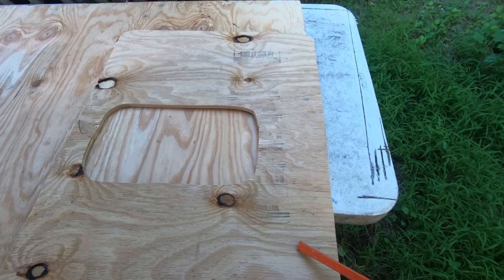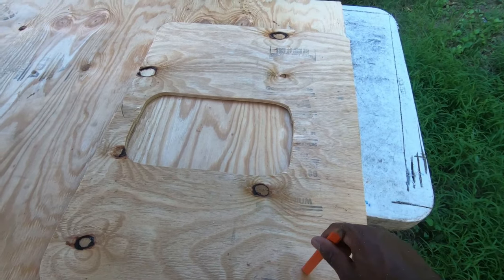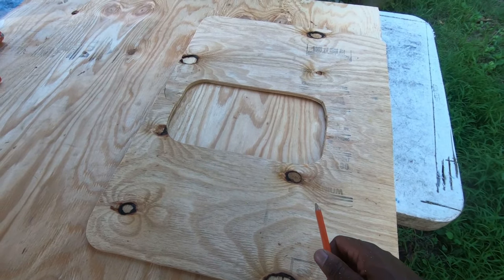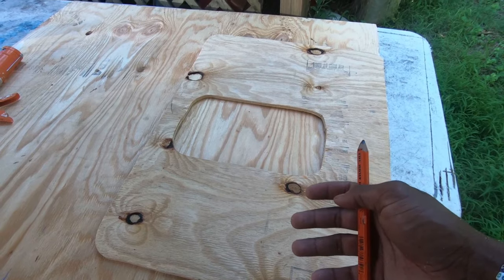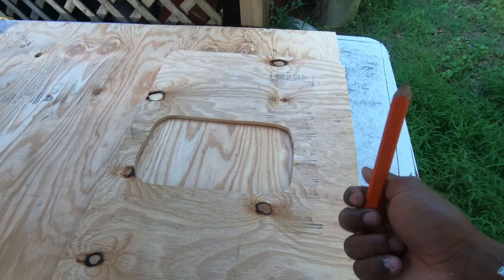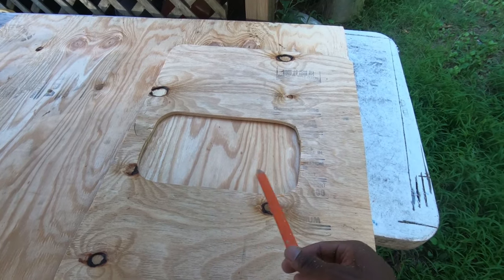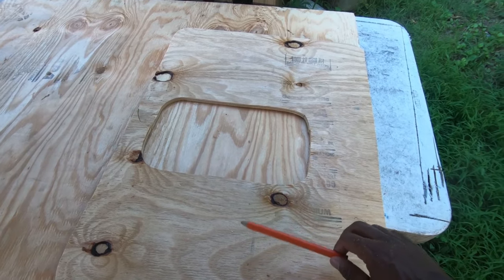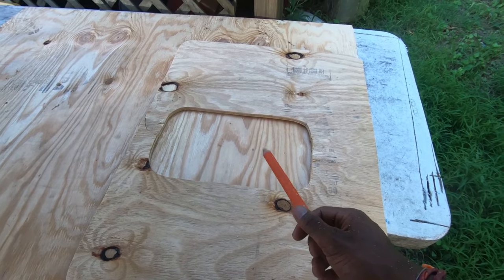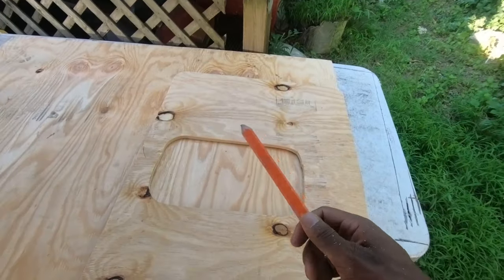So what I've got now is the door cut out. I'm going to trace this door onto another piece of plywood with the same thickness so I can have a front and a back — because a big issue with these is that they like to bow over time, and then they won't close right and won't be waterproof. What I'm going to do is cut pieces out, stack them on top of each other with no insulation in the door, then glue the pieces together so it's as solid as possible. They should be able to fit the windows inside the door once everything is set.